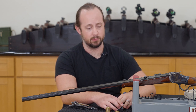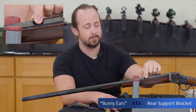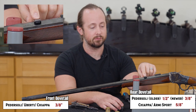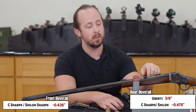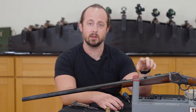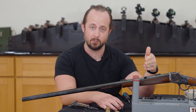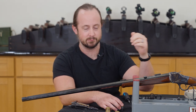It's time to get that scope mounted up on the rifle. One note before we get too deep into this: the rear bunny ears mount down onto this dovetail block here. There are quite a few different rifle dovetail sizes, usually dependent on the manufacturer, and each will have a certain amount of tolerance. Please let us know which manufacturer or dovetail cut size you have so we can fit you with the right rear dovetail block. All the dovetail blocks are just a little bit oversized or on the upper edge of the tolerances, so you can get a nice hammer-tight fit. If it's a little too big, just grind it down with a Dremel or a file and hammer it in place. We'll say at this point you've put this rear dovetail block in — it should be pretty straightforward.